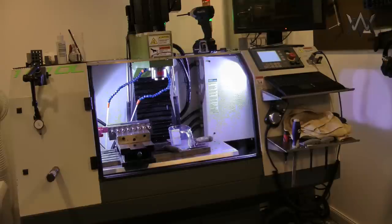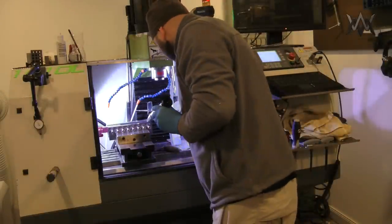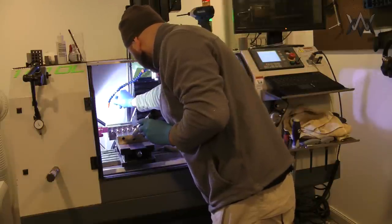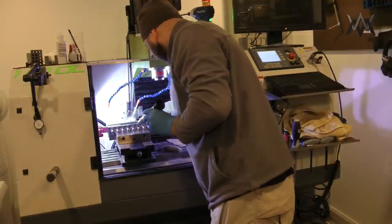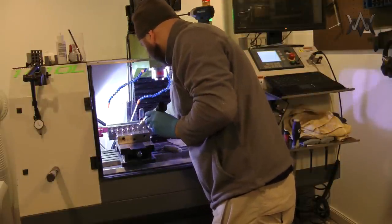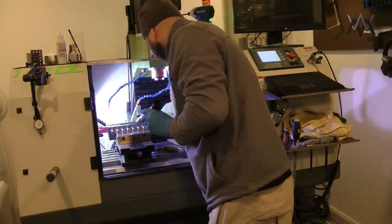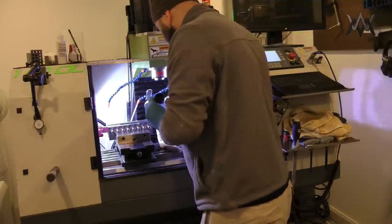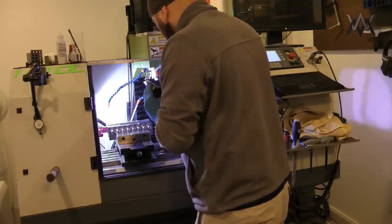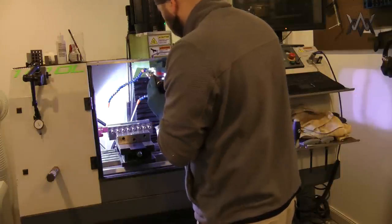Unfortunately, again, I wasn't recording when I turned it on, but the input was a solid 7.5 PSI, and the output was just a hair below that, maybe 7.4. And that's with one of the 350 micron filters that comes with it. Jason at Qualichem said that the 251C can be filtered all the way down to 20 micron, but you shouldn't filter below that because it could strip the oil, and 50 micron was just about perfect.